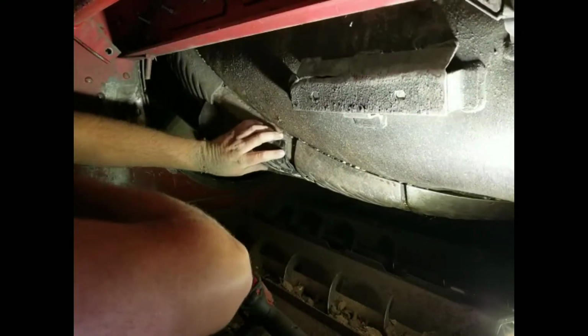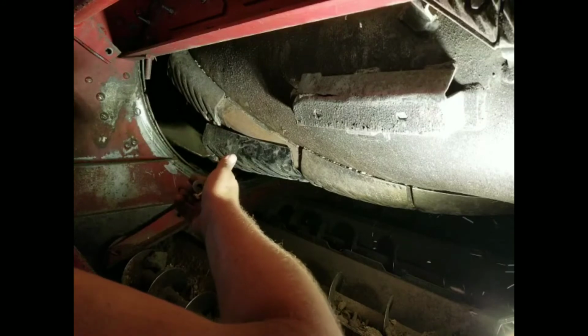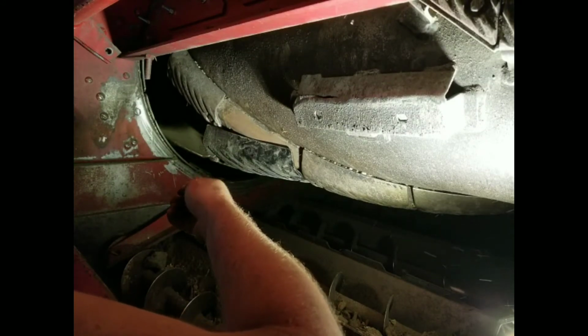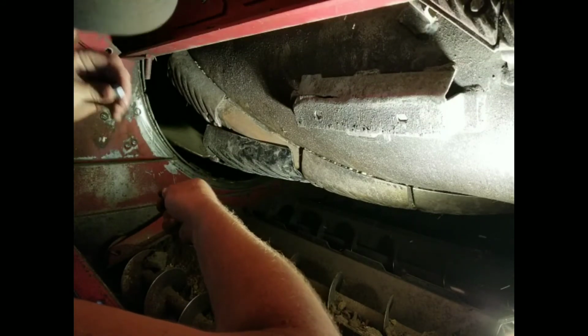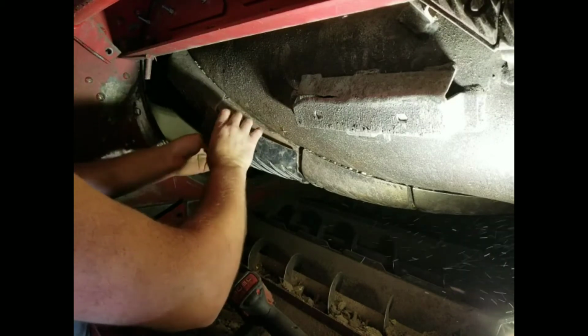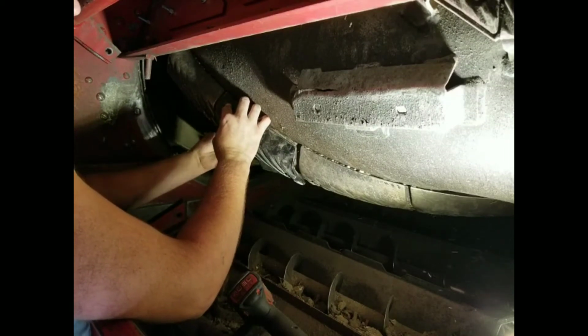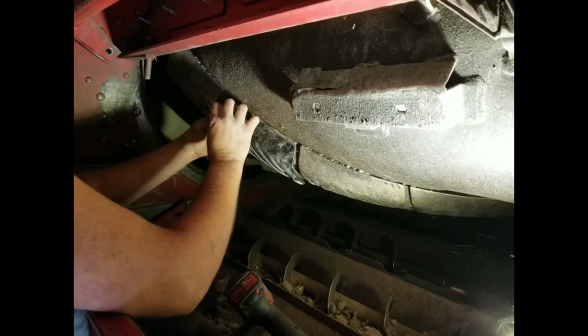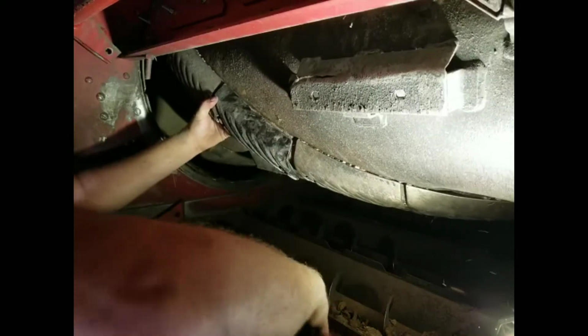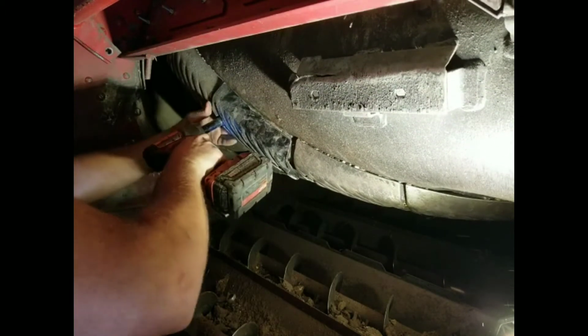They're kind of a lock nut, so they don't thread on too far. They're a clinched thread nut, so they're a lock nut. They don't thread on too far easily. That way they don't back off because of vibrations. Because as fast as this rotor turns, there's going to be some vibration. Okay.